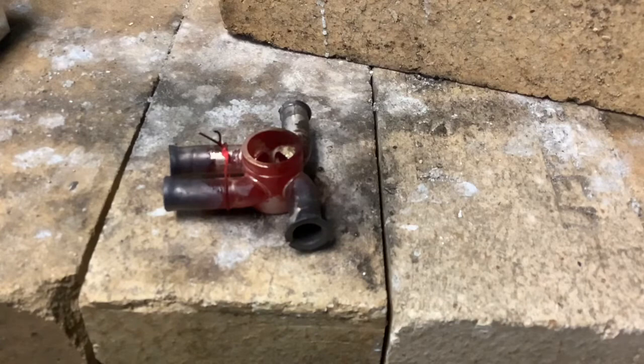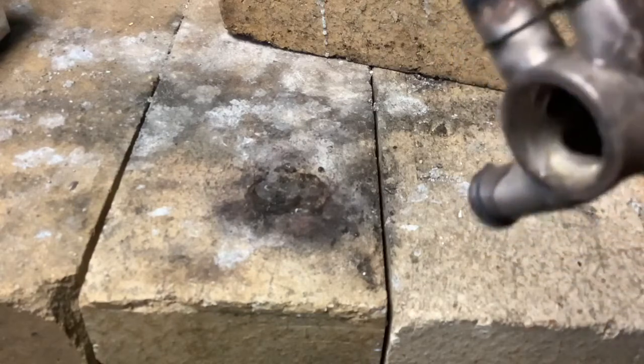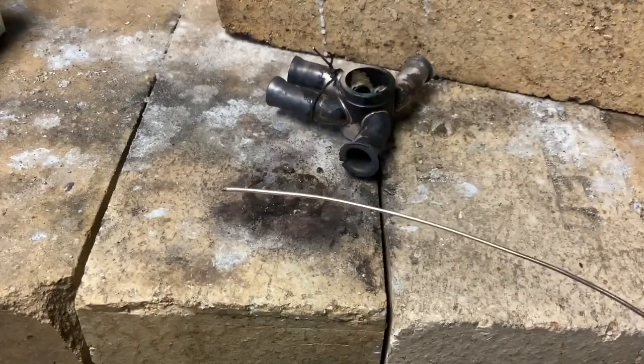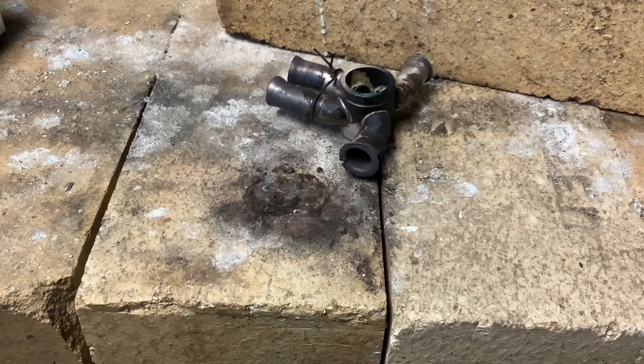That's it. My flame was sputtering out because I had turned my air compressor off. There's our brazed casing — it's that easy. I like to apply the solder from the inside, and as you can see we got pretty good coverage all the way around. This is a really nice flowing solder. I like a thicker silver solder in general, even for smaller parts — this is 1/16th size, the same as my bronze rods that I braze with.